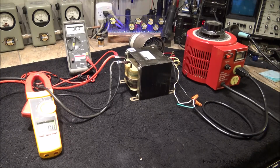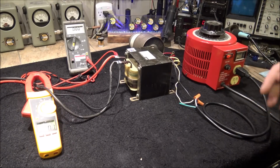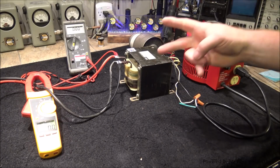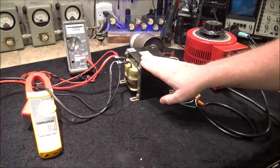There's no center tap on this transformer. This is actually a drop-in replacement for X-force power supplies that burn up, because we're not able to get the power supplies anymore. But there's lots of amps out there that need that transformer. It's in that particular style of amplifier built by the competitor, who doesn't carry those transformers anymore. So I had Peter design me this as a direct drop-in for that. The problem is when we got these transformers back, we figured out that this transformer actually outperforms the one we were trying to replace by twice. So anyhow, that's what this is.